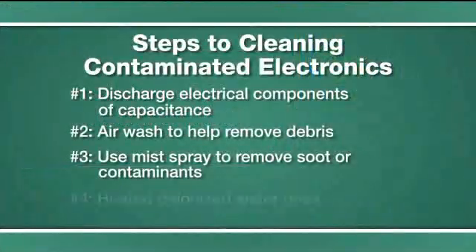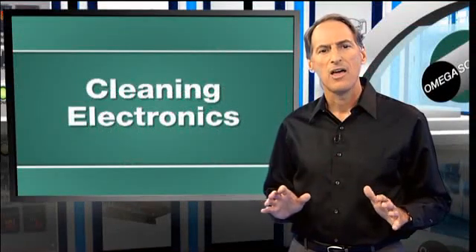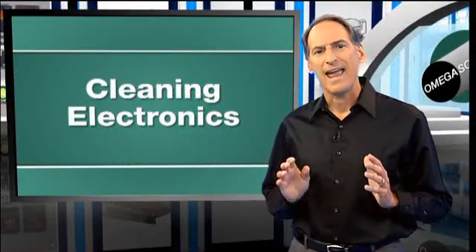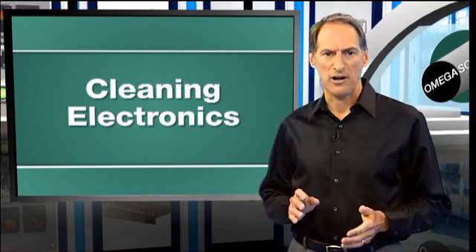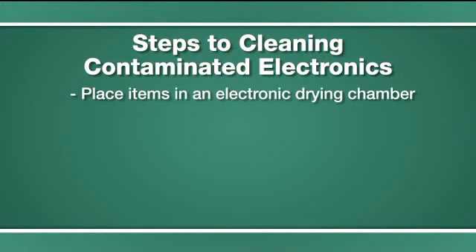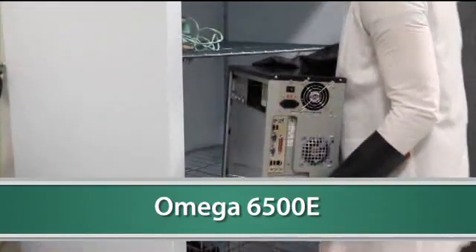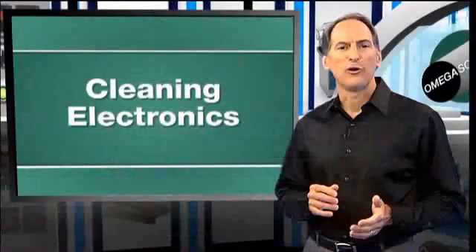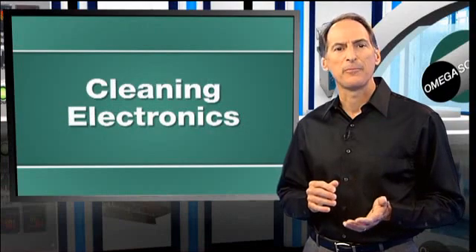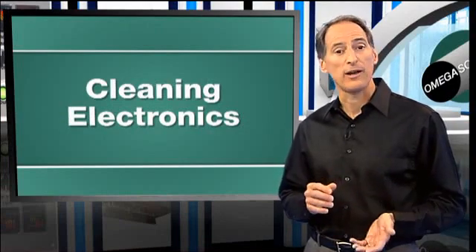This is followed by a heated deionized water rinse. All excess water is then blown off. This method can thoroughly and safely remove 100% of contamination caused by fire damage. Then, cleaned items are placed in a drying chamber such as the Omega 6500E for a minimum of 6 hours, where warm dry air recirculates over the components to ensure thorough drying. A small bowl of deodorizer is often placed at the bottom of the drying chamber to help remove any odors from the plastic pores of the electronics.